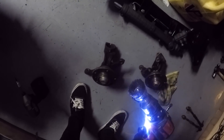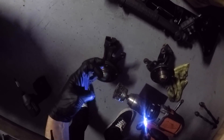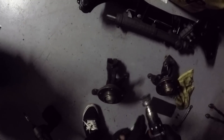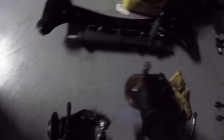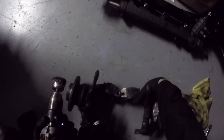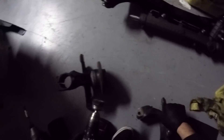Pro tip with these wire brushes: as you use them the bristles will start to twist a certain direction. If you flip it and spin it the other way it'll get super abrasive again. So if you're seeing no material come off, flip the direction on your drill and it'll start coming off quick. That looks night and day — you can really see the difference in cleanliness. If things are clean it just works better, and it's better to work on too.